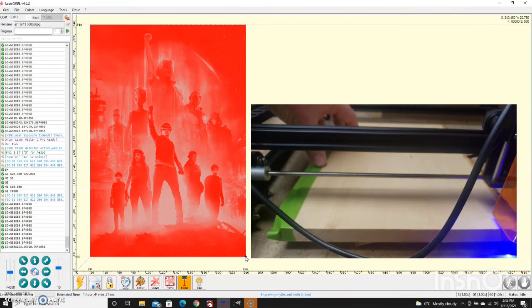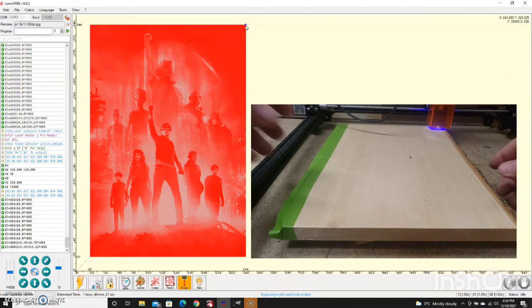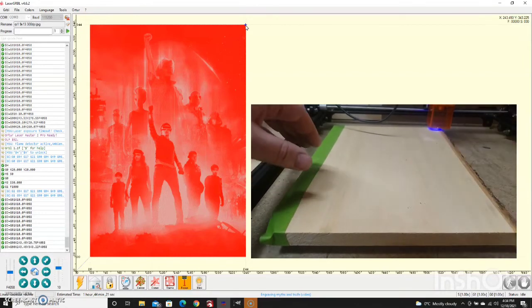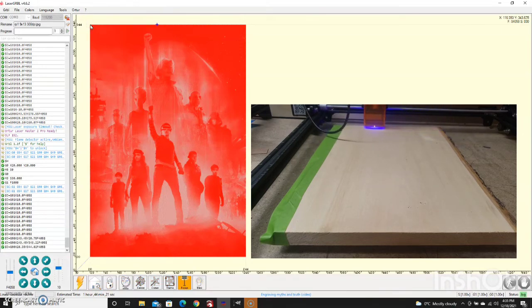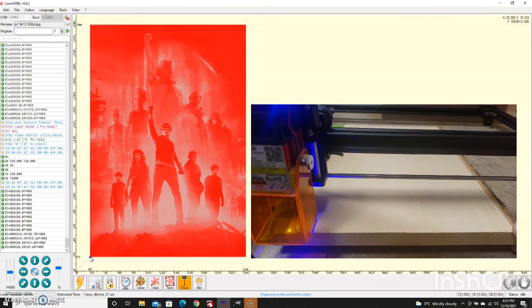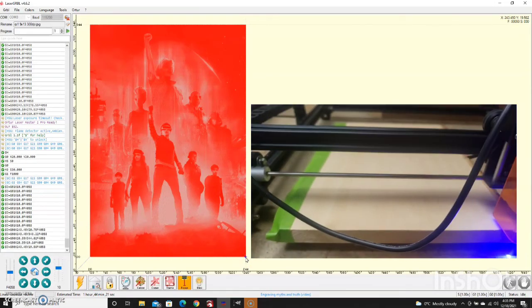Even before it's fully loaded, go to the corner — it knows where it's at. Hit your Focus button to turn your laser on, come in here and get it set where it's overhanging the tape and the bottom edge. Then go to the top right corner and you can see if the laser came off the board — came off where my tape would have been — so I want to move it over. You can see how you kind of square it up: just keep going around doing all four corners until you get it to where everything's going to stay on the board. Maybe you'd have to blow this image up a little bigger to actually fit onto this board, but that's how I get my image centered up — just keep clicking around going corner to corner until it's going to stay on the work piece.